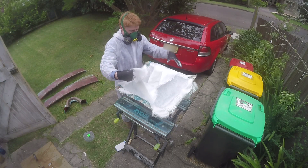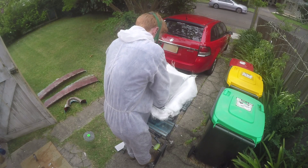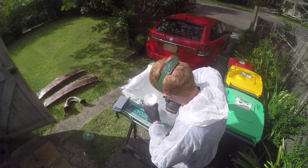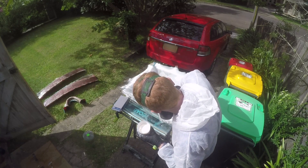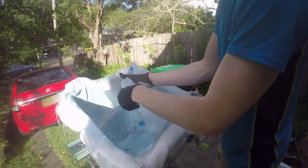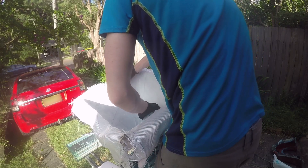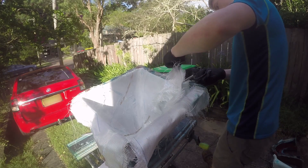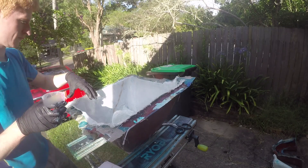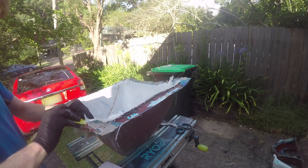I laid a second layer of fiberglass on top and wet it out as well. Then I covered the inner surface in peel ply. This finely woven material allows excess epoxy resin to seep through but does not stick to the part. Once removed, it also leaves a surface that can be easily recoated or painted without any sanding or pre-preparation. After 24 hours the epoxy had set. I used heavy duty scissors to trim the excess fiberglass, then slowly split the part from the mold, pouring water between the two as it helped to dissolve the PVA and assist with the release.